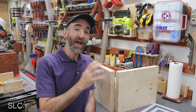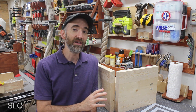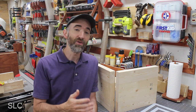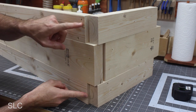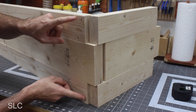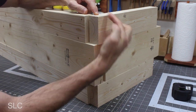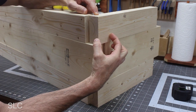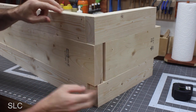With everything ready to assemble, I could use dovetails and I could use dowels. But I've got to remind myself, this is going to be used and abused by kids. So I don't want to make it overly fancy, but I do need to make it strong. So I think I'm going to use a really basic finger joint. I'd love to assemble it with the 2x6 in the middle and the 2x4s on the end as their own fingers, but that wouldn't give a whole lot of support to these side boards, and of course, kids. So I'm going to cut out a little section to create a finger on this board and a finger on this board, merge those together, and do the same on the bottom as well.